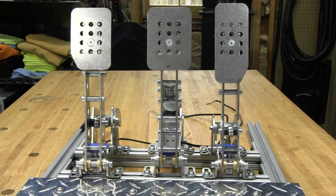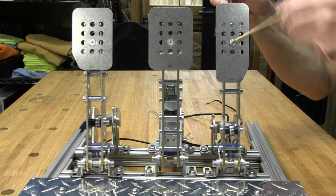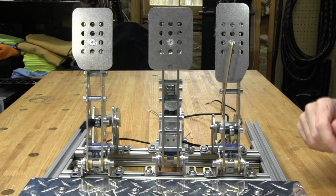To change the position of the faceplate, get the three millimeter wrench in there, hold the nut in the back, and loosen it. I'll loosen it until I feel it get really loose — when the nylon of the safety nut disengages from the metal threads on the screw, then you can take it off with your fingers. Be careful you don't want to lose the little washer back here.